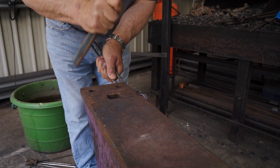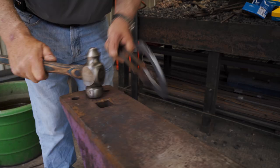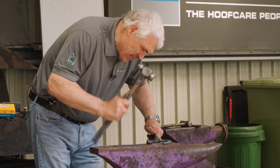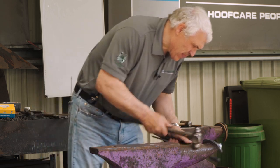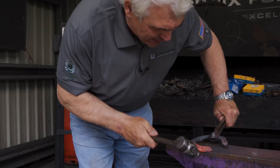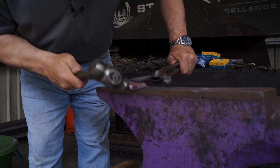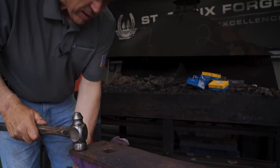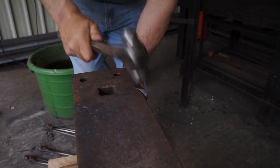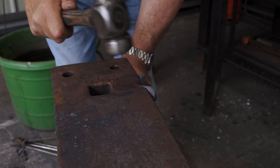Walk the clip up — you get marks in it, take the marks out, then bring it up again. Don't leave big marks in your clips. Level behind it, set your clip — there's one done. Now we're going to get the other clip done. Start with that clip, hitting into the corner, keeping my left hand pulled so it doesn't roll. Set my base — it is setting your base before you start drawing your clip. Then draw your clip part of the way, polish the marks out, then come up at it again, polish the marks out.